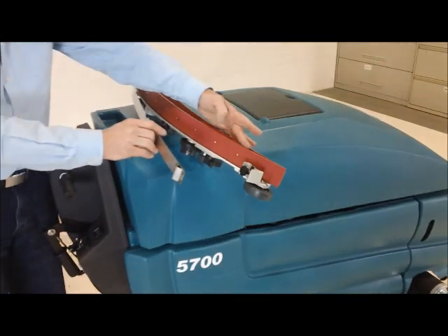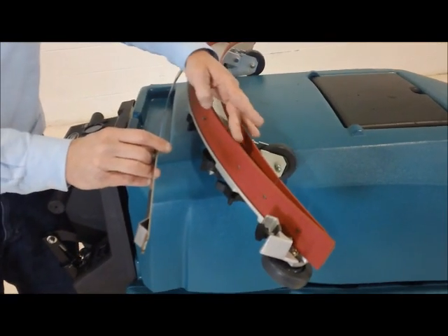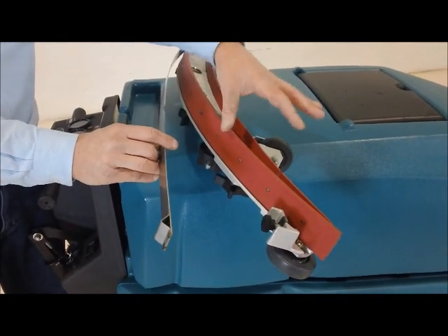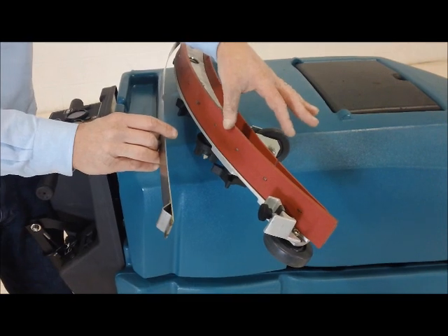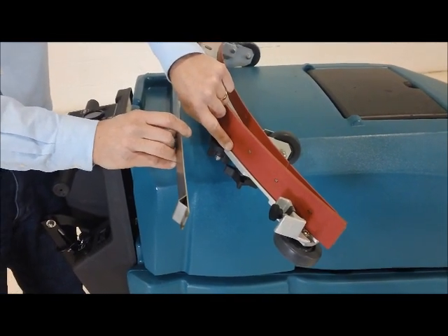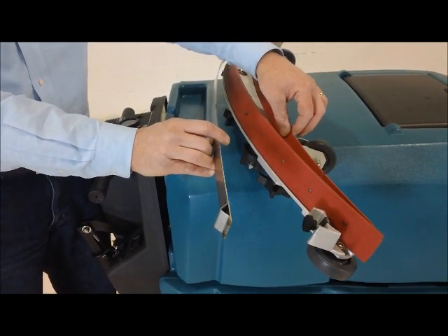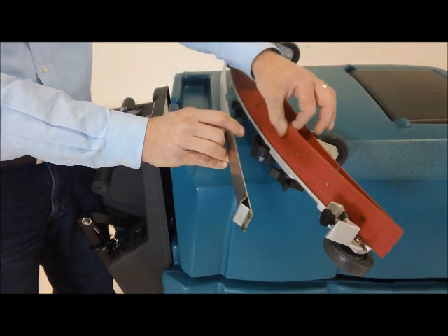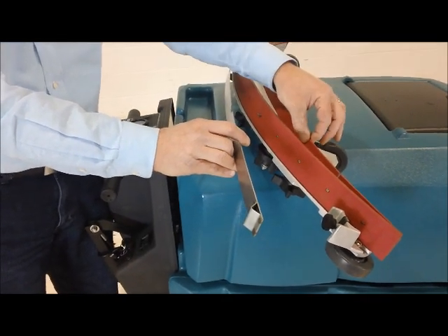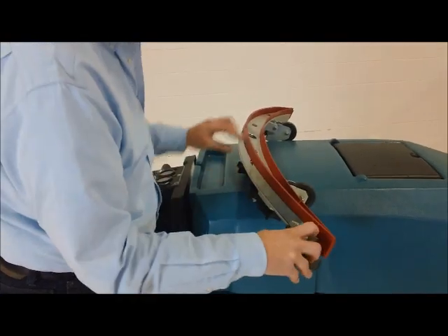The reason that's important is we have to keep a sharp edge. The leading edge of the squeegee needs to be as sharp as possible, and that's going to wear down over time. When it wears out, we turn the squeegee around and use the back of it, and once we wear out that edge, we've got two more on top — so it has four usable edges. The front blade is not as critical; you just need to change it whenever the rear blade wears out. So if you order a squeegee from us, we send you both. No tools are needed to do the basic maintenance on this machine.